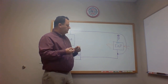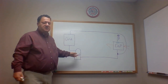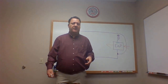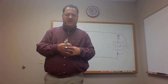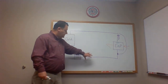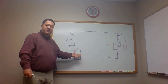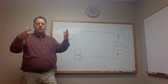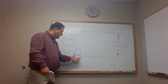All right? As we get into our suction line, we come into our compressor. By the way, I'll probably get a lot of comments on this. Let's just say 85–90% of the compressors out there are refrigerant cooled, okay? So this suction gas, the first objective it's doing, where we pick that heat up, is cooling that motor as it comes in across the compressor, no matter what compressor it is. You're cooling it, if it's refrigerant cooled, okay? We're cooling that compressor, all right?